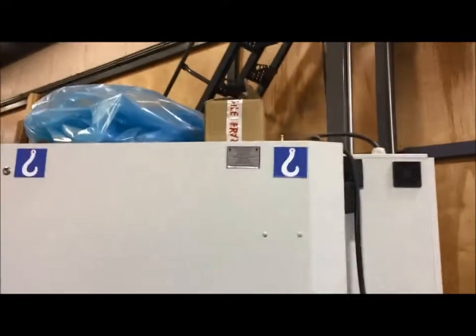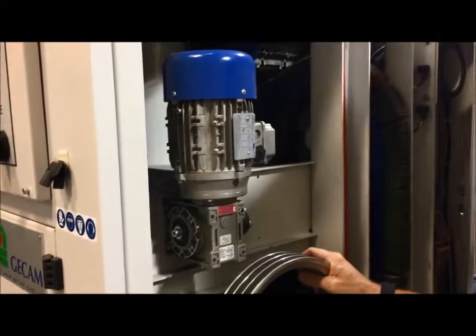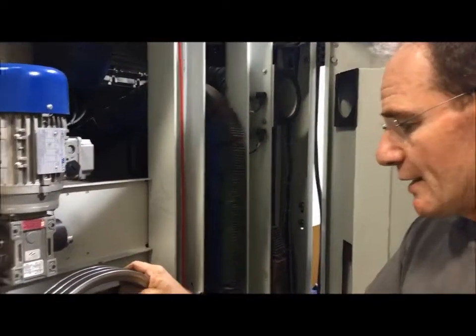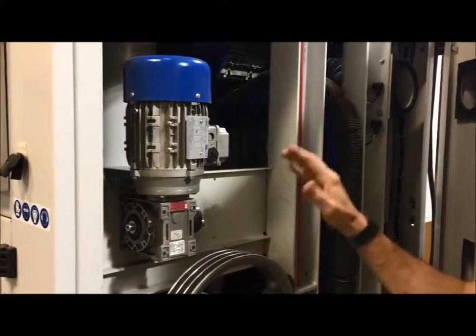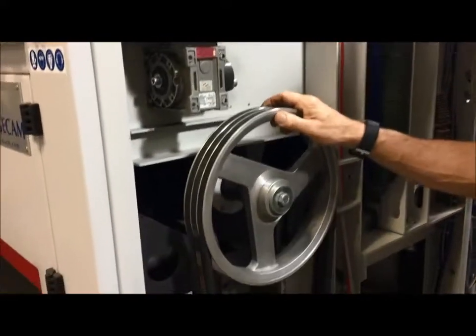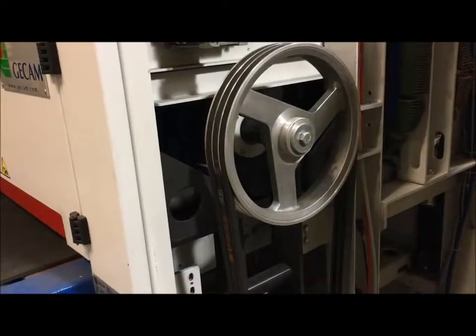Then over here, we have a machine with a deburring drum. This big round drum, it's hard to see from this side, and the deburring drum is very soft on the surface, and it mainly removes material from the edge, and it doesn't leave a secondary burr, but it still leaves a sharper edge. It's not broken yet, but this can remove a lot of dross and slag, but this is more like for flame cut parts or laser cut parts which really have bad dross.